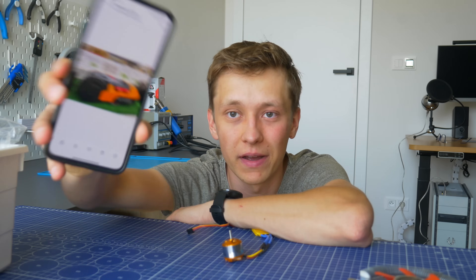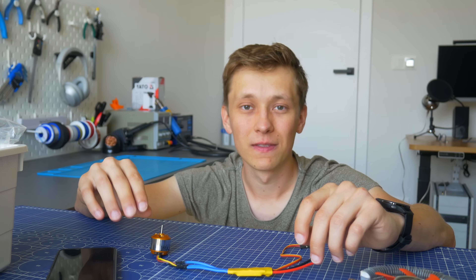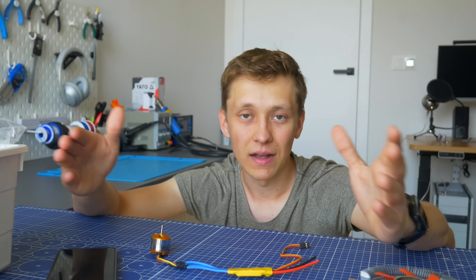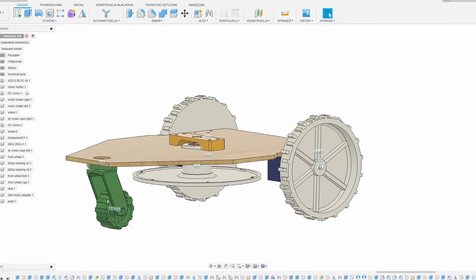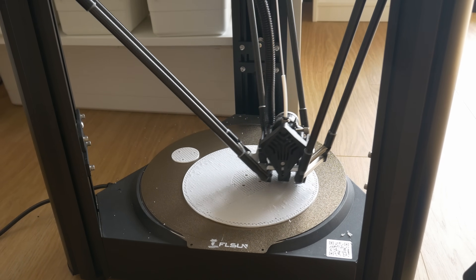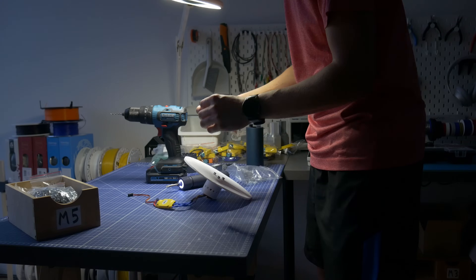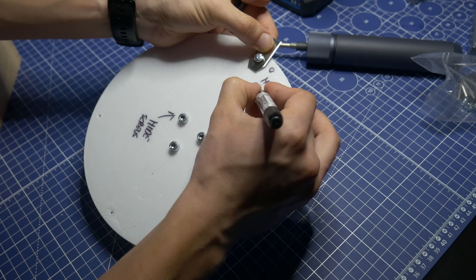I did some spying two days ago and took pictures in the store of a robotic lawn mower. I honestly wanted to over-engineer my project a lot, but after looking at that one I now have a much simpler idea. The most important step is to design a very durable cutting mechanism because it will basically run all the time the robot is running. Everything started with a Fusion 360 design — very rough, not polished — and later you'll see me using a drill a lot. It was printed on an FL Sun V400, but later I switched to my brand new Bambu X1 Carbon. There was a lot of drilling, and I wrote notes directly on the parts about what to improve in next versions. A simple Sharpie and a few words on each part can really help in designing the next iteration. Totally recommend doing that.